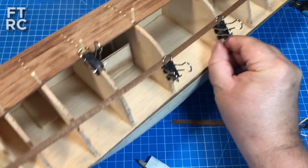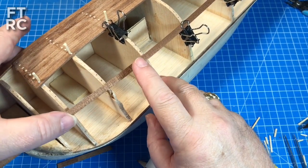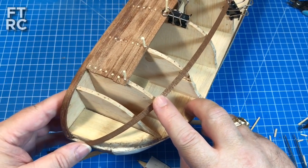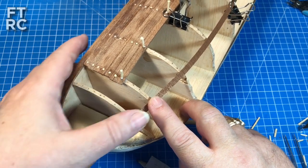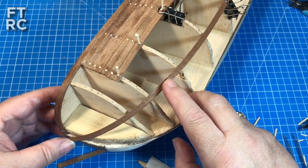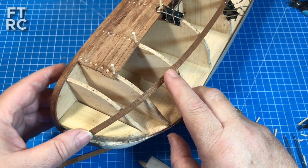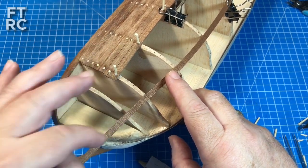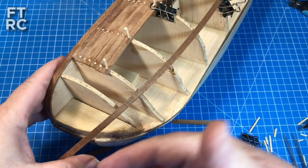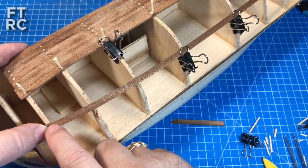But they're going to get thinner, and this is what happens. I'm using this thin plank because it's easier to get the bend to the hull. And as you see, as it goes further forward, see how it curls up? This is what I was trying to say. The planks will try and curl up, and this is their natural position. So when you're bending them, you're going to need to bend a little bit of that curl out, but you can't get it all out, and that's why you taper. And anyhow, they'll get all crammed at the end. It's like trying to shove too many big fat teeth in a small jaw, which is my problem. So its natural curve is to there.